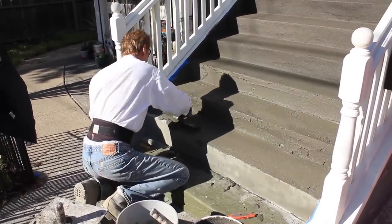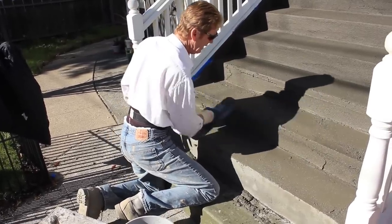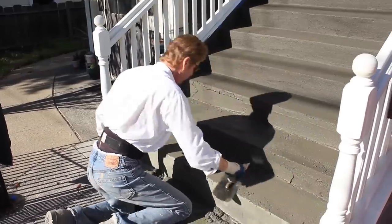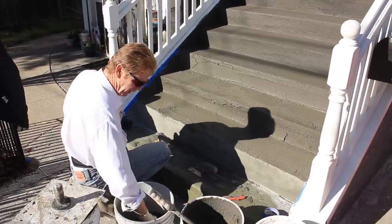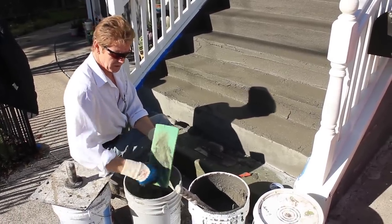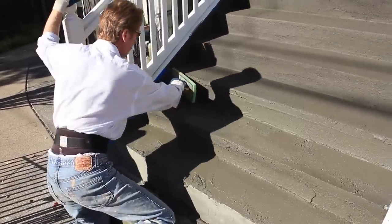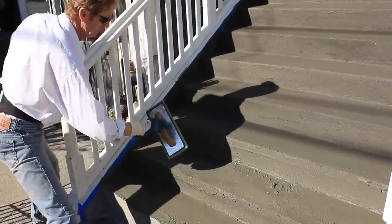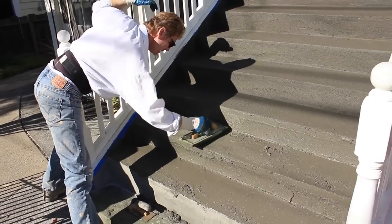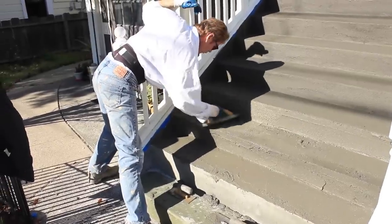What's the advantage of an acrylic color coat on a walkway? This stuff will last forever — paint would fail quickly, even the best paint money can buy. When you're walking on it, it just destroys the integrity. Now I'm taking a sponge float, with just water, and cleaning my gloves. Wear the raggedy-est clothes you've got. I'm pulling the aggregate out — this takes a little practice in the hot sun. I have to keep the sponge float wet; if I don't have enough water, it'll drag.